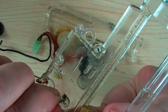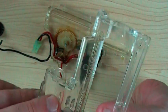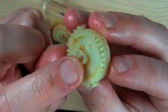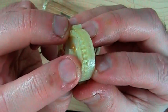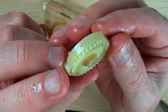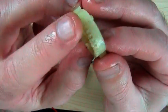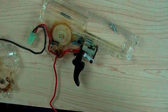The shaft came out where it normally rides in this housing. It started to heat it up, and then it just drug it sideways and the gears stopped contacting each other. But you can see where it went sideways and it just buzzed this gear right here. So that's what happened. Shaft melted the housing, gear went sideways, buzzed off a few teeth, and the gearbox.